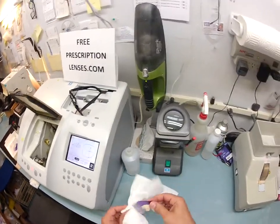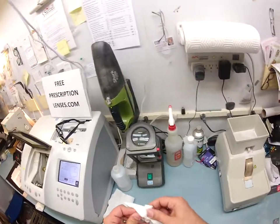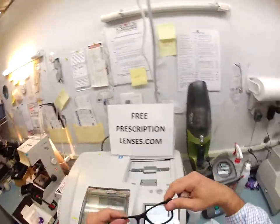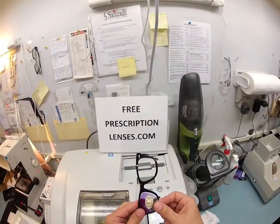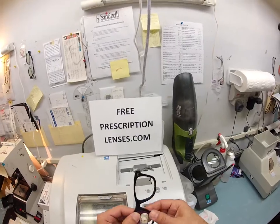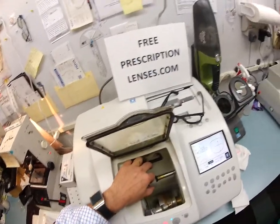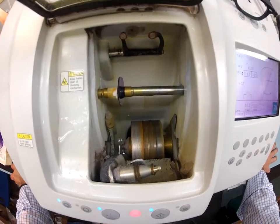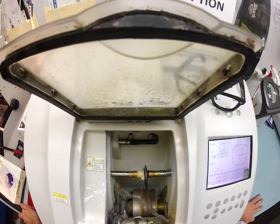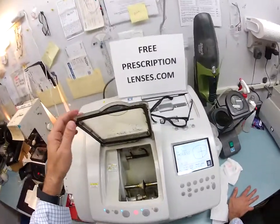Back to the hand stone where I'm going to put the safety bevel on there. I'm going to dry your lens off and clean your lens before I put it in the frame. I'll be shocked if this fits - usually have to go a little bit smaller. That's pretty cool, the purple over that. This is my first time cutting a purple lens in a while, so I'm enjoying myself. It doesn't pop in there yet, so I'm going to take it down just a tenth of a millimeter and hit retouch. It's not going back to the cutting wheel, just back to the bevel wheel, which will take one tenth of a millimeter off all the way around.